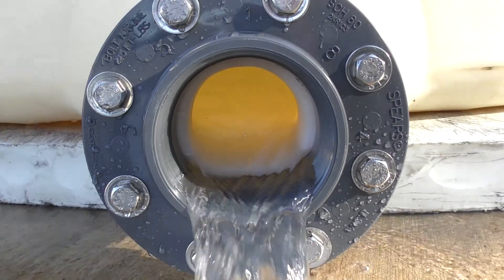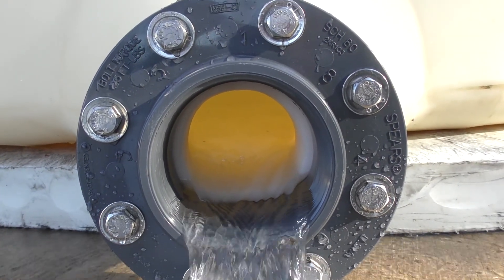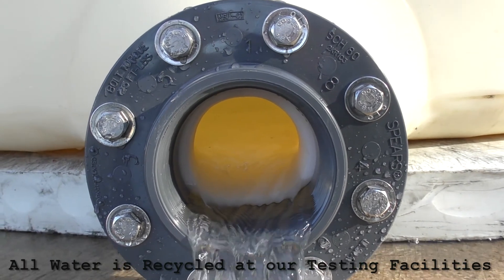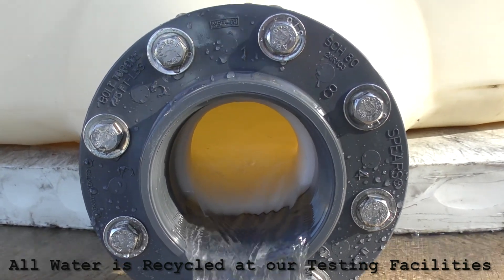The IMFO on the slope-bottom tank is molded as an integral part of the tank, and it's not a metallic insert molded in or added after the tank is produced. The IMFO is located at the bottom sidewall of the tank and permits full drainage since the outlet is below the knuckle radius. These tanks can be fully drained and cleaned to flush sediment out, which is especially important to alleviate confined space entry into the tank for cleaning purposes that could cause a safety issue.